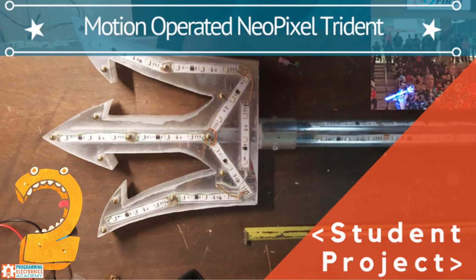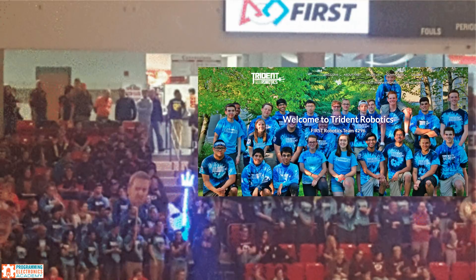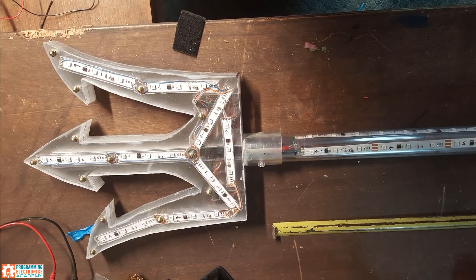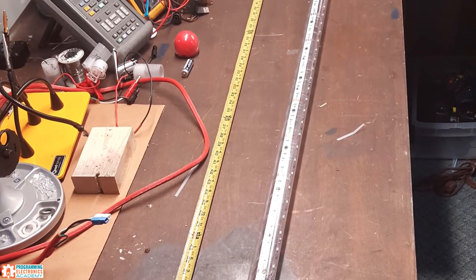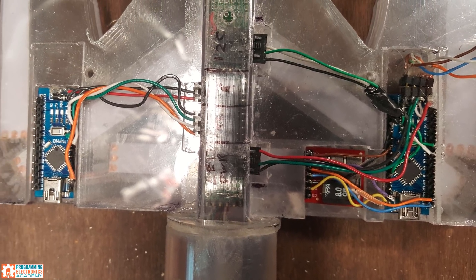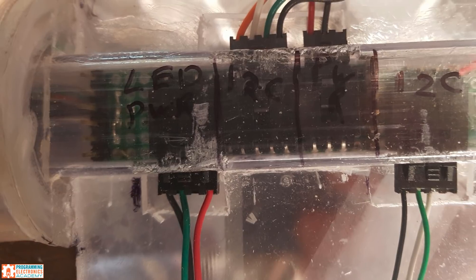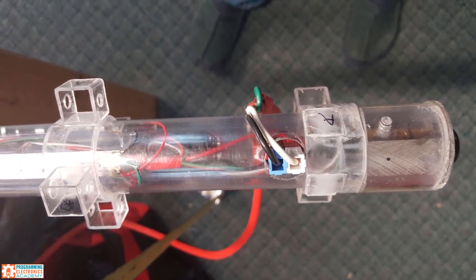The second project is a six-foot-tall NeoPixel blazing polycarbonate trident. It's used to cheer on the home team at FIRST Robotics Competitions. It was made by FIRST FRC Team 4296, Trident Robotics, whose mentor Mark Bala was a member of Programming Electronics Academy. It's made of polycarbonate tubes and sheets and uses 12-volt DC NeoPixel strips, each with three RGB LEDs per pixel — a total of 70 pixels or 210 LEDs. An Arduino Nano on the right side controls the LEDs and connects to an SD card reader where the LED patterns are stored. Two SparkFun 9-degrees-of-freedom inertial measurement units communicate to a separate Arduino Nano so the trident can detect different movements and adjust its display accordingly.